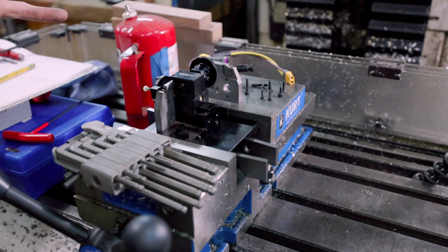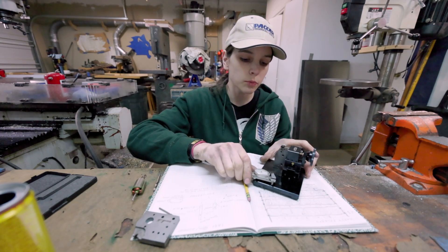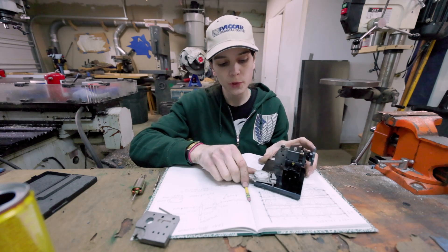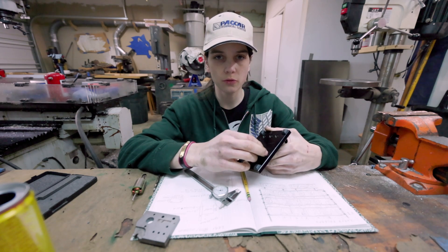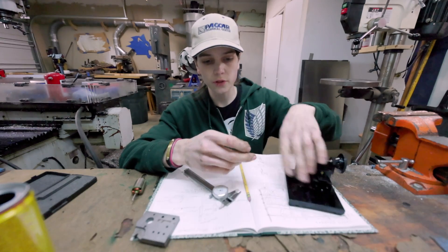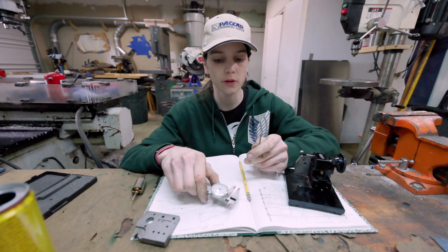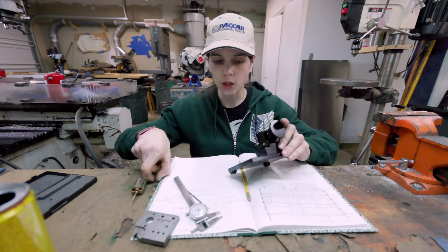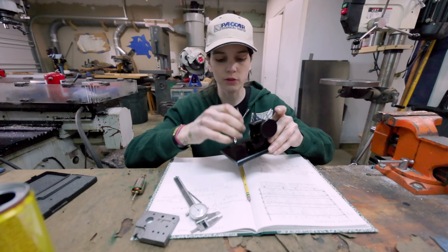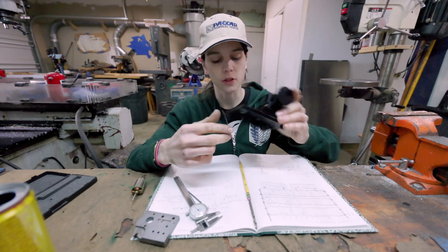I think I have a grasp of what's going on here. My alignment dowels are 0.115 inches in diameter, and the hole they are press fit into fits a number 32 wire gauge drill perfectly — a 32 happens to be 0.114 inches in diameter, so that's a thousandth smaller than the alignment pin, making it a press fit. The center hole, the big hole in the middle, is a number 10, so that is not very crucial since it's just a screw hole. I'll have to countersink it on the bottom, but that's no big deal.